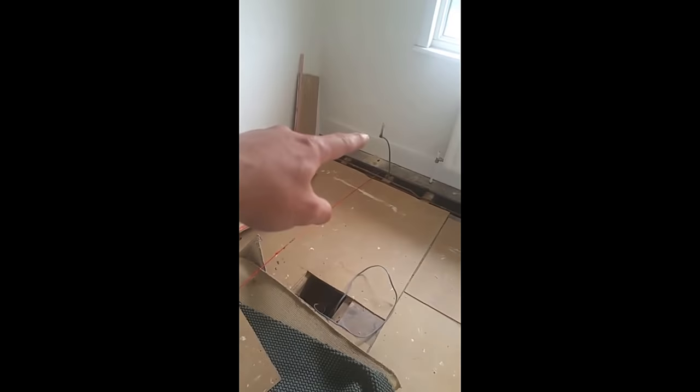We're going to use the old hallway socket route up to the loft — we've got a loft radial circuit for your sockets and for your lighting cable, which is also going to do the smoke alarm. We've run up in the skirtings ready so that will feed the light switch and that will feed the socket. There's a socket behind the skirting, there's a socket behind the skirting.